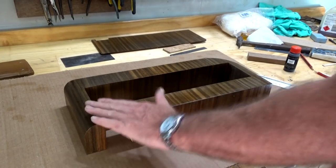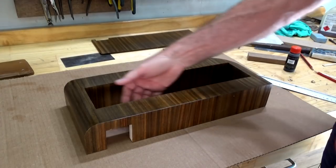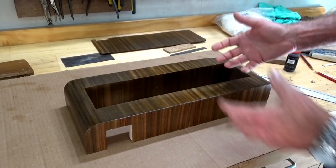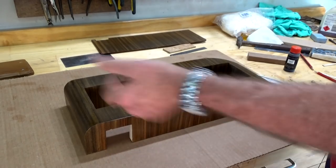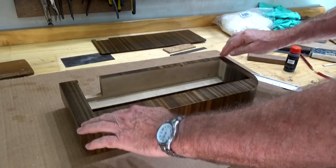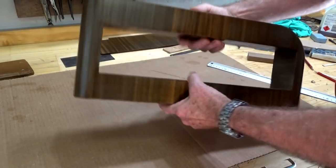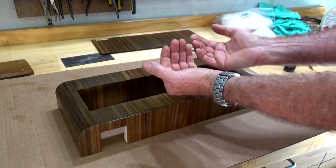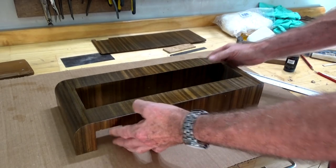Now, before I go to this stage of putting on this lacquer, I have to admit to you the awful truth about working with MDF, and that is that I completely underestimated the amount of expansion and contraction I was going to get with this material. Now, I was working on this the other day. I put the clock over onto its face like that to work on the back, and I was working flat on the bench, and I noticed that the whole clock was rocking backwards and forwards, and I couldn't figure that out. I turned over and had a good look, and then realized that this section here of the clock carcass had bowed up and laterally as well, and the amount of movement in that material was incredible.